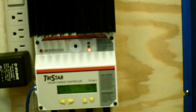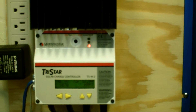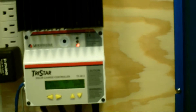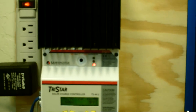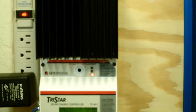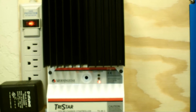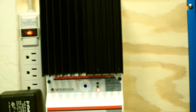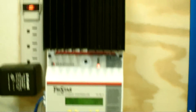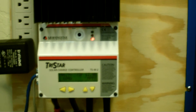These charge controllers can operate either 12-volt, 24-volt, or 48-volt. I went with 48-volt because it's a lot more efficient, and it allows me to use all my arrays. The way this charge controller works: if it's set up as 12 volts, its maximum wattage is 800 watts. If it's at 24 volts, the maximum wattage is 1,600 watts. And if it's at 48 volts, the maximum this thing handles is 3,200 watts. I have 2,800 watts worth of panels, so I have a little bit of leeway there.